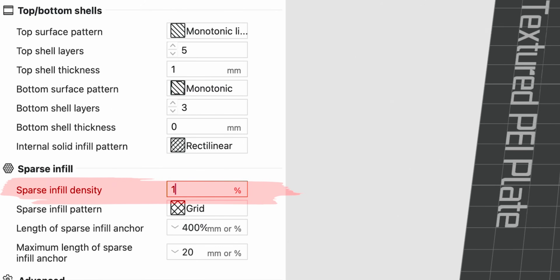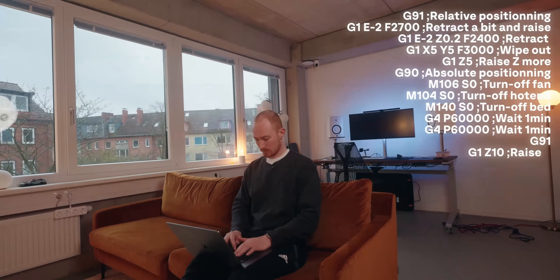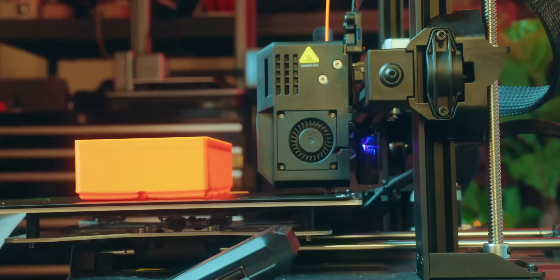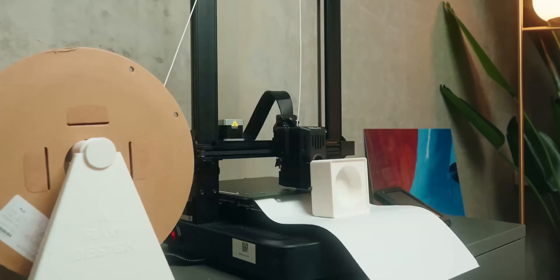I really hope this video helps you make your prints go faster. If you're looking for which tip to do first, do it in the sequence I showed in this video — dropping down the infill and using lightning infill will likely keep the quality of your prints really well for a long time, and after that you start to degrade a little in quality. Another thing I do to speed up throughput is automate my printer so it prints without me and keeps cycling through prints, which was huge while building my Gridfinity system. Go watch that video and I'll see you in the next one.